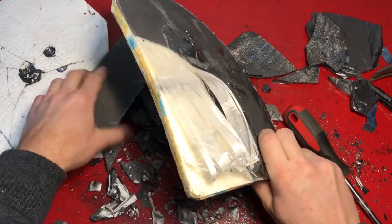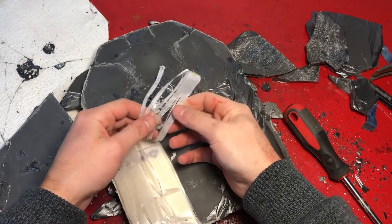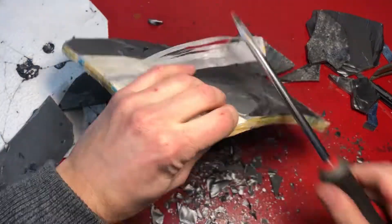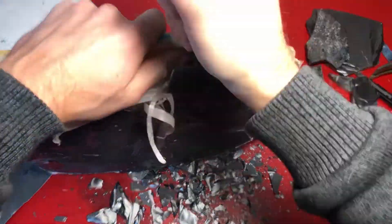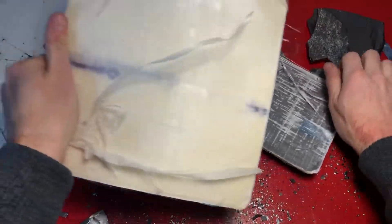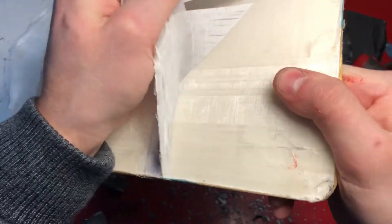This layer is basically just a sheet of plastic that separates the polyethylene from the boron carbide. These are individual layers of laminated polyethylene that came up when I was prying this off. This type of polyethylene basically looks like sinew because it's laminated layers that go in one direction and layered on top of each other, instead of being woven like typical fiber.